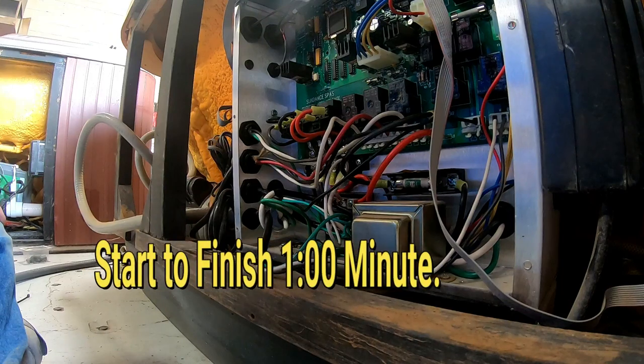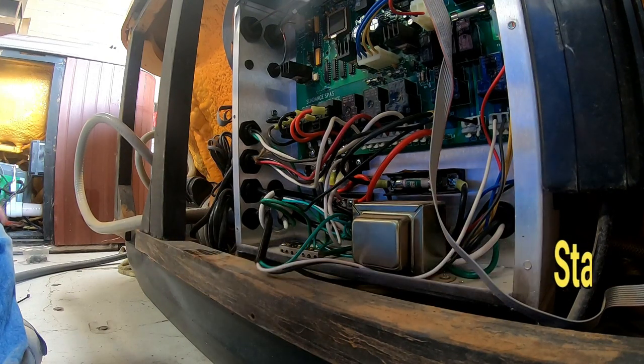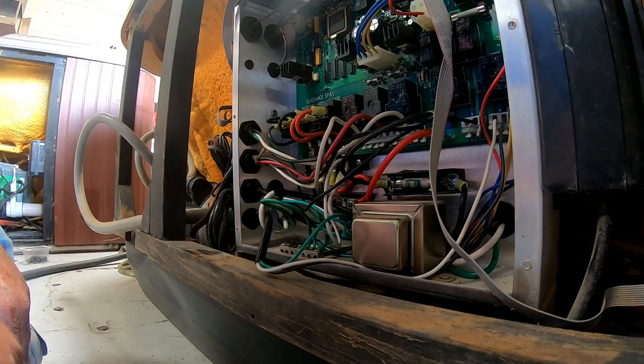I don't know how long that was, but I will put it in the caption for you guys. That's all there is to it. I hope that helps you guys get your hot tubs up and wired in a couple minutes. I'm just showing you where to look for the wires and kind of where they go. Line 1 and Line 2 are always your hot wires, you've got a common wire that's white, and the green wire that's ground. Make sure you mark everything, and above all, before you touch anything, shut the breaker off. I'll see you guys on the next video. Thanks a lot, everybody — have a great day!